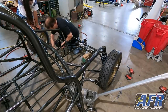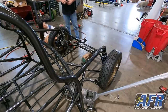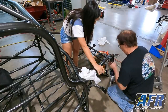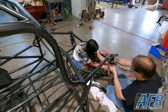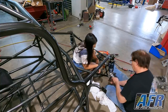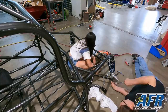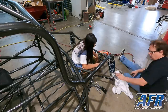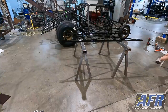So those are strange struts. They're on the car now at this point with Dad's adjustable cups up front, which was nice. Which was necessary. Oh, did you see it roll? Yeah, it rolled. I think I'm out of order. I built this to be sitting like an inch and a half lower than it does. And we wanted that originally, that was our goal. But that was going to require bubbling those quarter panels. So in the haste to get this thing together, I cranked those cups down an inch and a half, and it's perfect. It actually sits good. We'll probably never actually lower it at this point. Had I just welded the struts in, we'd have been in trouble.